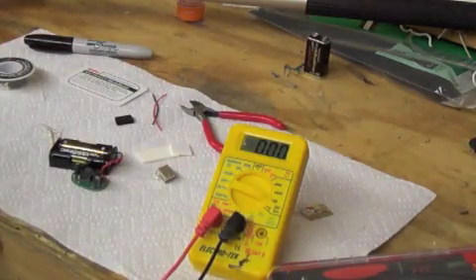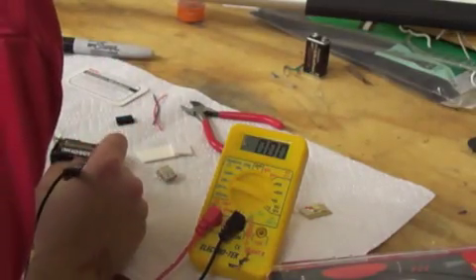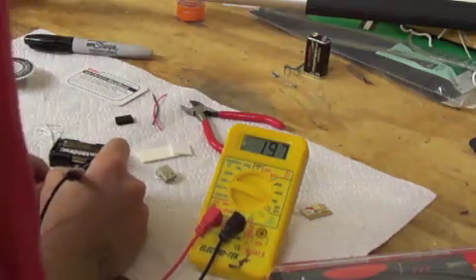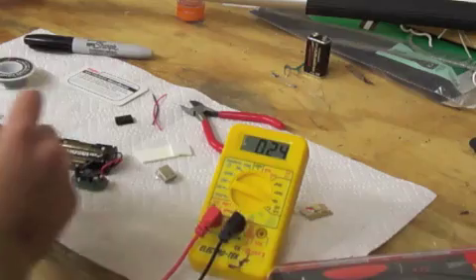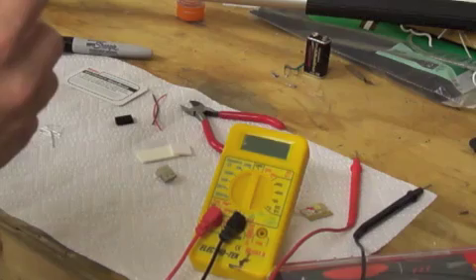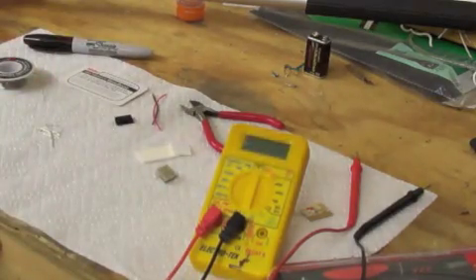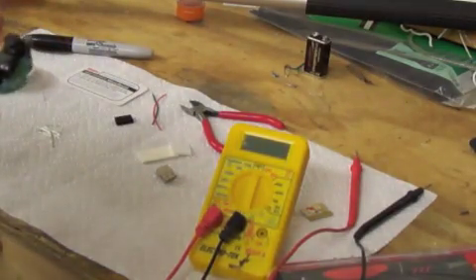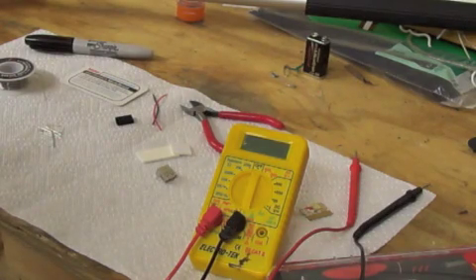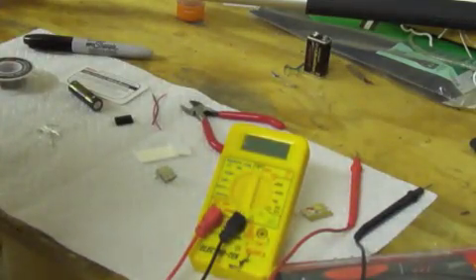The second and third pins should both be about 2 volts, and grounding it over here — 1.97, 1.97. So that's working. That's our voltage check on the little thing. It says to feel both the batteries and the board, and if either is hot, take out the batteries and check your soldering, because there's not supposed to be any overlap on certain parts. I am using Panasonic Alkaline Plus — I don't know if that has any bearing necessarily on what happens, but you never know.